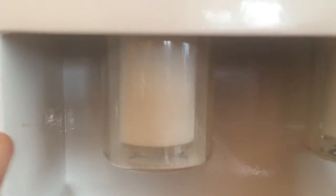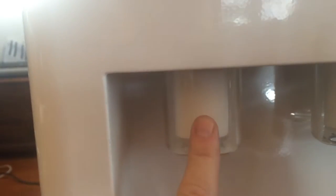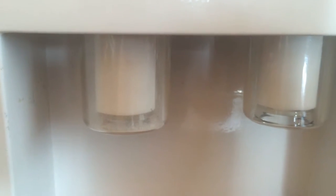These have been replaced. This was the color of the powder coming off of the rear filter when we received the machine from you. So both of the filters now are clear and white as they should be. The front filter is the secondary filter and the rear filter is the primary filter, or the first filter in succession. The filtration system filters through here and then here. So this one will always get dirtiest first. When it starts to turn gray like this, that's when you need to take it out and replace it. You order new filters from us.